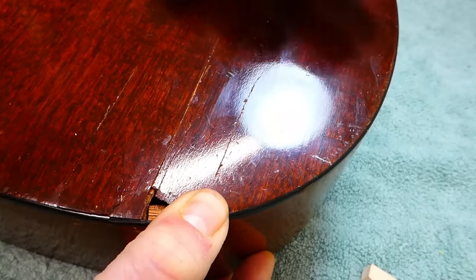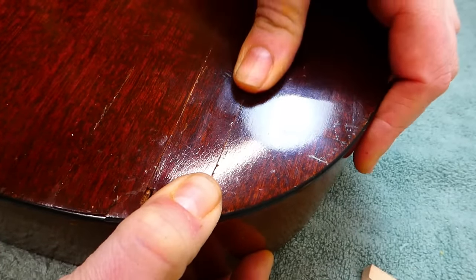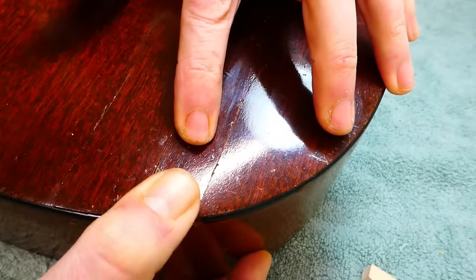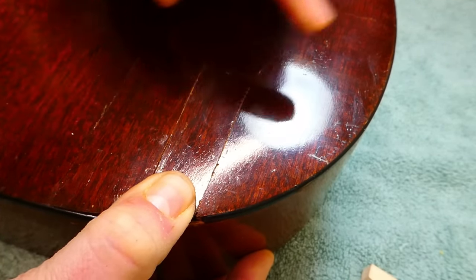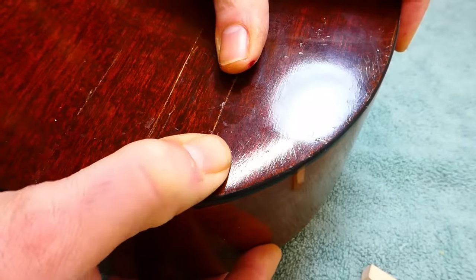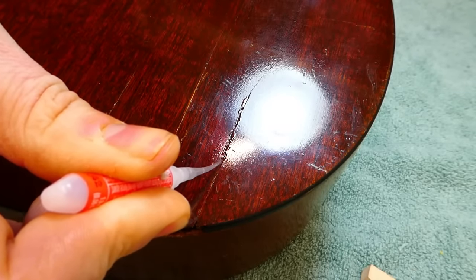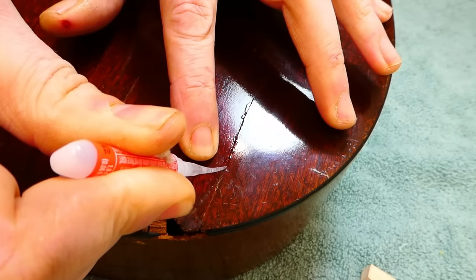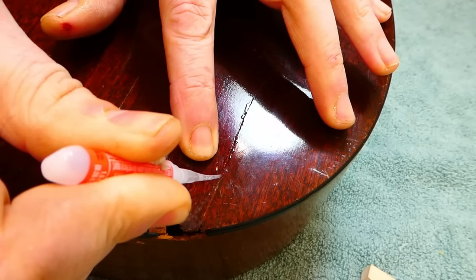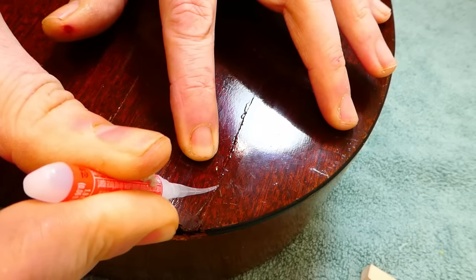So I'm actually going to start off by using thin super glue on these cracks, because they're so thin that they're perfectly tight and we're dealing with capillary action. If I can hold these together while it sets, I can do them one at a time and get this into one unifying plane, then I can work at sticking that back down again. I can't conceive of a way of doing them all together at the same time. The super glue is going to be the quickest, most reliable way of doing that. I'll put cleats on these afterwards to hold them in position. The other thing about the super glue is it doesn't have a tendency to swell up the wood, which could make fitting the other pieces together even more difficult, because they're very tight.